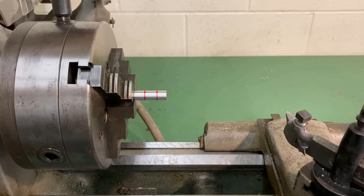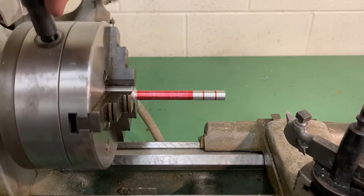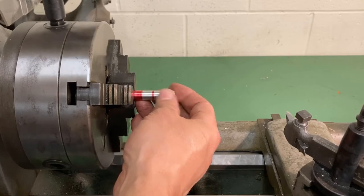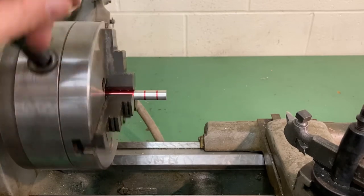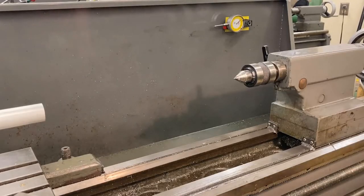We're going to use that three diameter rule the entire time in this class. There's going to be one time when you think setting up a certain way is the only right way to do it, but it's not. You can actually slide a part all the way up into the headstock and clamp there so that you don't break the three diameter rule. This is a rule — it is not a suggestion. We are not going to break the three diameter rule in this lab.